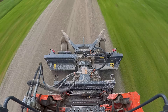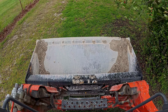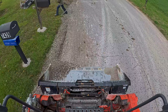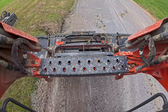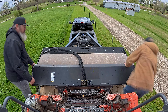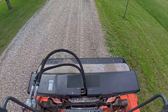At the same time we're sloping it to the downhill side, creating a steady slope — in this picture the left side is higher than the right side. Now we're going to pick up the bucket and do some finish work: making sure everything's nice and spread out and level, doing those fine touches. We do a lot of hand raking that we don't tend to show much in our videos, but it's where we can really get things perfect and fill in those tiny pockets that are hard to touch entirely with the bucket.